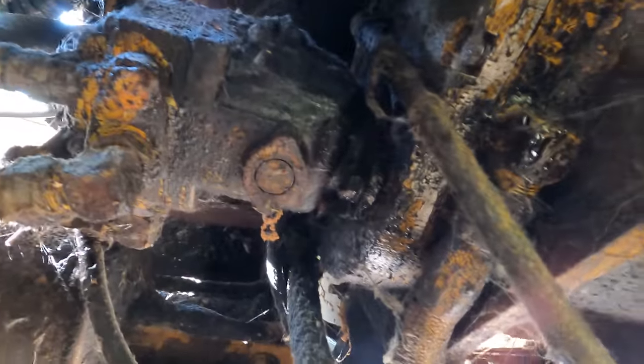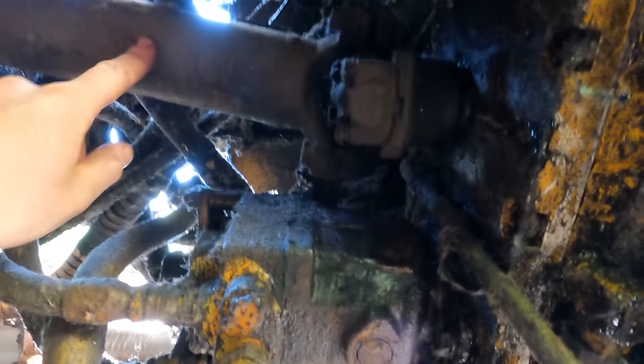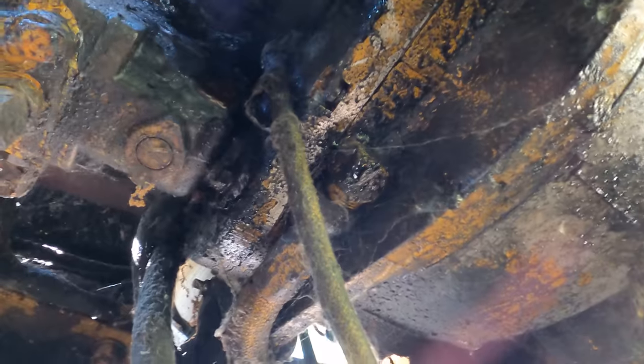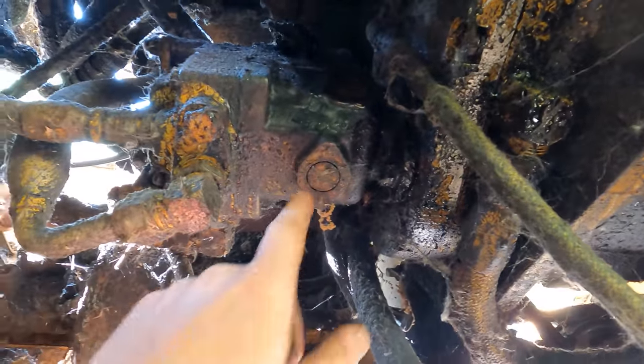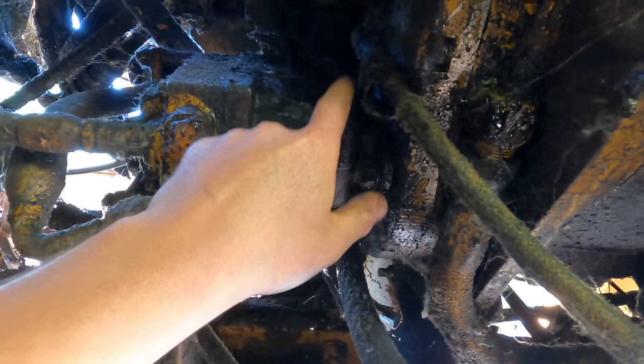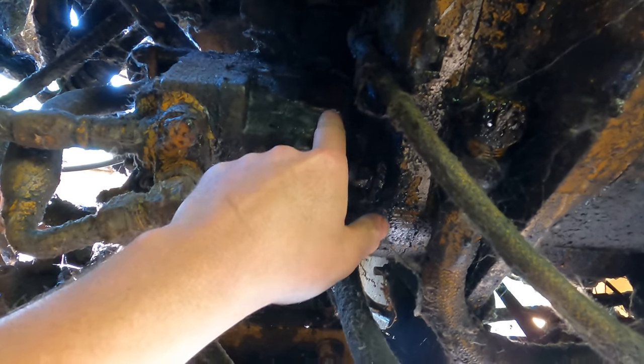All right, so one day Bill's going to tell the story of this. But if you look, see all that weld on there? See his welds. So the drive shaft right here, I think this is the main transmission drive shaft. Here's the engine. U-joint busted. We should probably get in there and grease these, actually. So the drive shaft busted and it hit the steering pump. It's like one of those Vickers variable displacement pumps, I believe. They wanted like $1,500 or $2,500 for a used housing. Not for the used pump.